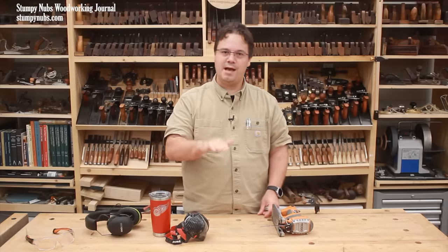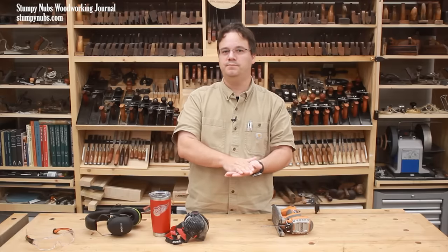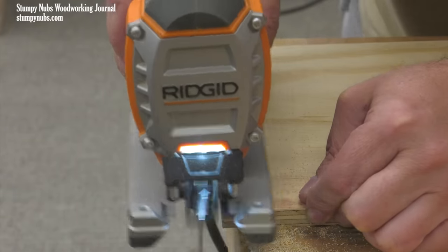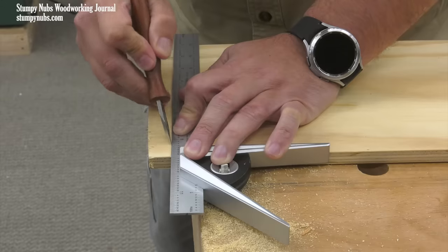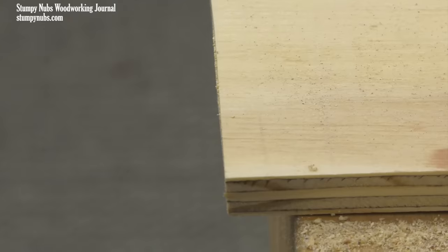But what if you need a clean edge on the top side and can't flip the workpiece over? Reverse tooth blades are available to cut on the downward stroke — these are mostly used for cutting laminates such as countertops, but you have to hold the saw tight on the surface as you cut, and that just transfers the tear-out from the top surface to the bottom. If you can't tolerate tear-out on either side, put a piece of painter's tape on the top side and cut through it — the tape helps reinforce the surface fibers. Another option is to use a knife to score the fibers along your cut line for a crisp edge, though scoring a curved line can be more difficult than a straight one.